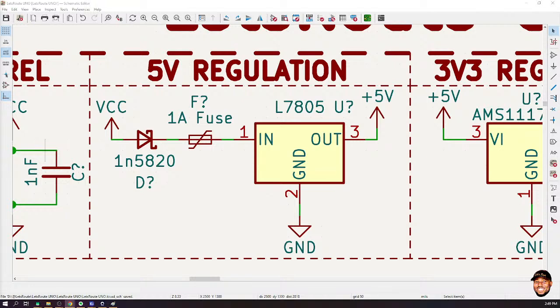I also like to find out, you said you have the reset fuse. Yeah, the poly-resettable fuse. How does it look? It's just a normal fuse, but let's say we insert a poly-resettable fuse of 1 amp. When it reaches its trigger point, it breaks down like a normal fuse. It will remain in the breakdown state until the short circuit condition is over. Then it will recover back as if nothing happened.